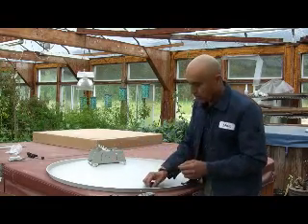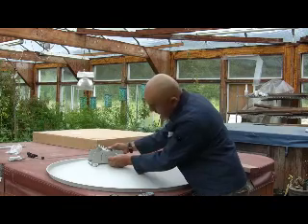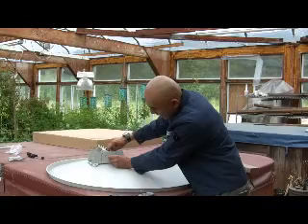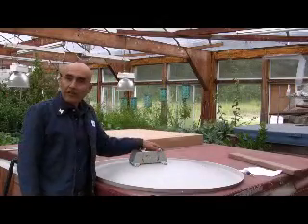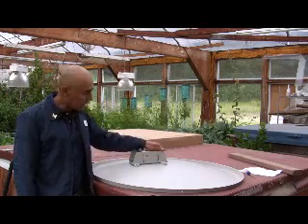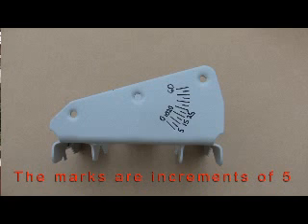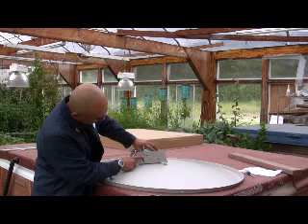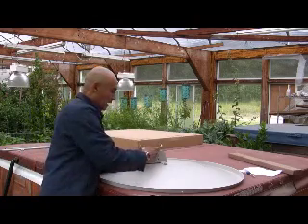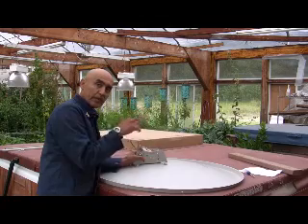The screws with bolts are the number 9 — they will fit inside the hole. Proceed to put on all the screws on this bracket. I've placed all 6 number 9 bolts on the reflector bracket. As I mentioned in previous videos, my elevation is 31.6 degrees, so I'll proceed to place the bracket itself on the mark for 31.6 and snug that down. That way when I place the dish on the pole, the elevation is already preset to the closest mark available.